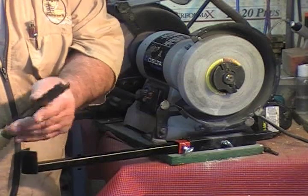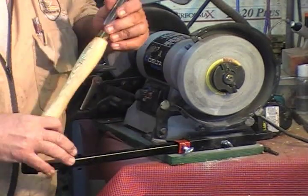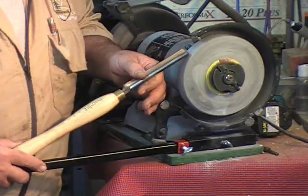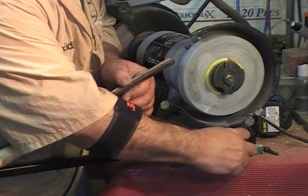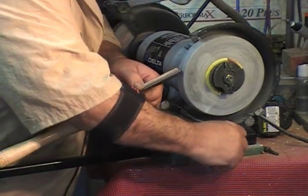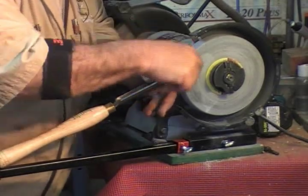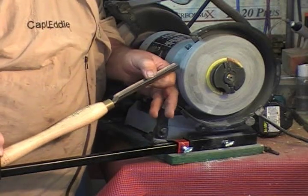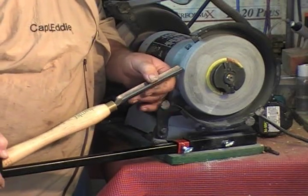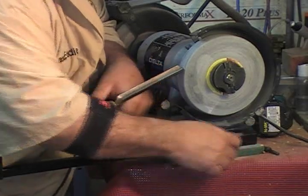This is a roughing gouge. I blackened the edges with a regular Marks-A-Lot — this is where I bring the old marker from the office. Doesn't matter what color. Now I'm going to pull this out and lock it down. I'm looking over the top to see what the gap is right now, looking down through there to see if it lines up or not. Then I'm going to tip it in and tip it out until it gets there, and then I'm going to lock it in place.